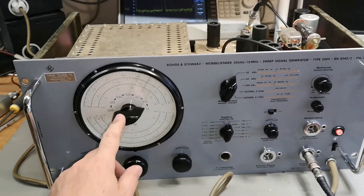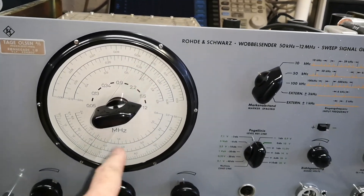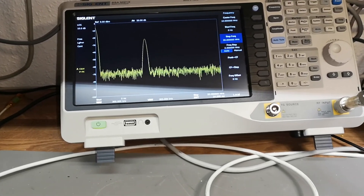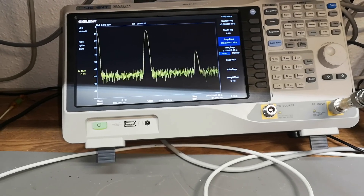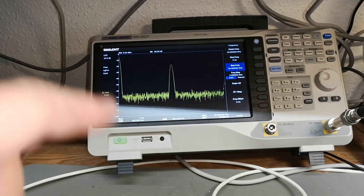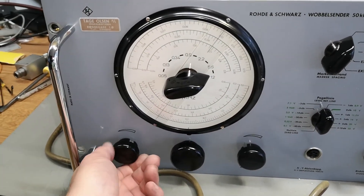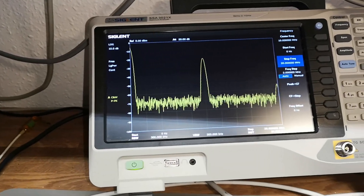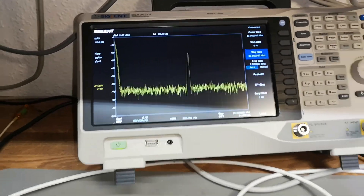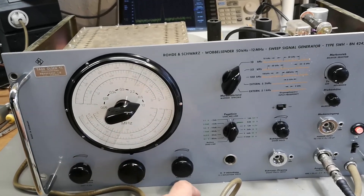I think there's only one last thing to show and that is to connect it to a spectrum analyzer. I'm now in the 5.5 to 12 megahertz range and we can move the output. We can see a little bit of harmonic and dial the output on and off. The reason why you see these blinks is because the output actually does turn on and off — this system is modulated. Let's look at the frequency variation: I crank it up and we've got frequency modulation. Anyway, I believe this thing does what it's supposed to do, so I will call it quits now. Thank you very much, bye bye.